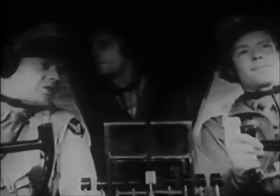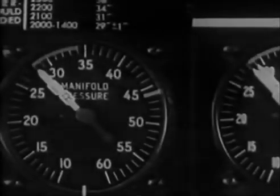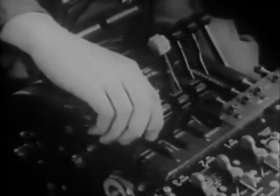Thin air means higher rate of compression from the supercharger, and compression makes heat. In the wrong places. Nearly always in the wrong places. You level off at 10,000 feet and cut her down to the proper setting for maximum long-range performance on 91 grade fuel. Manifold pressure down first to 28 inches. RPM next. You make this adjustment with one eye on the airspeed indicator because you use whatever RPM needed to get 150 miles per hour indicated. In this case, with your conditions, 1,600 RPM. Then fuel mixtures to auto lean. And your co-pilot closes cowl flaps since you have a safe margin in head temperatures.